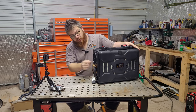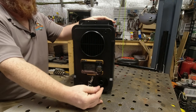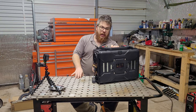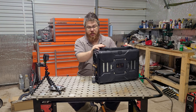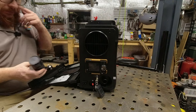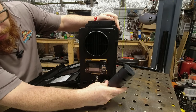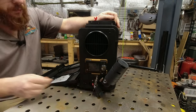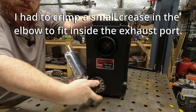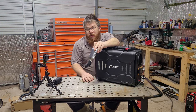The unit comes with some brackets to mount on either side so that your intake and exhaust pipes for the combustion chamber come out, up, and are stabilized by the brackets. I've chosen not to use those because that's one extra thing to stab into stuff in my car. Instead I'm just using stubby elbows. I will have links down below for the heater and all the parts needed for the modifications, including this elbow here for the muffler.